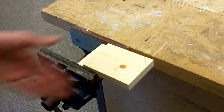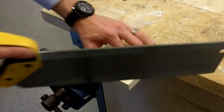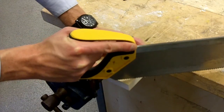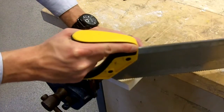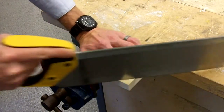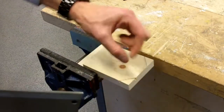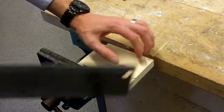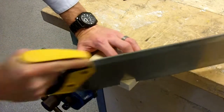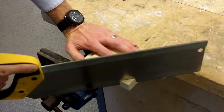Stand at an appropriate angle so that this line is going between your legs. Then front of the saw on the table and just drag back — once, twice, three times. Just cut off the corner. You will find this is much easier because we are not cutting the whole length, we are just cutting the small piece, so this will be much quicker. As you get to the end, just slow up a little bit so we don't rip through the wood at the back.